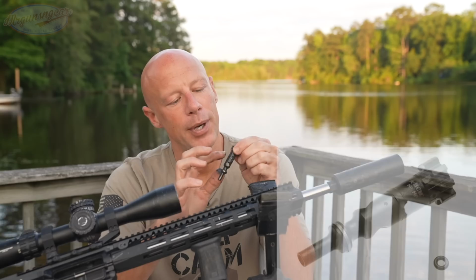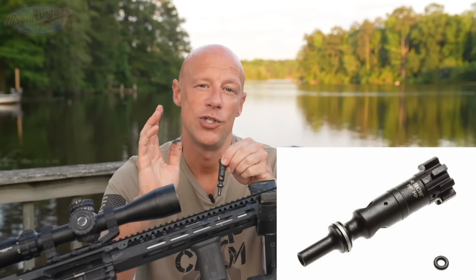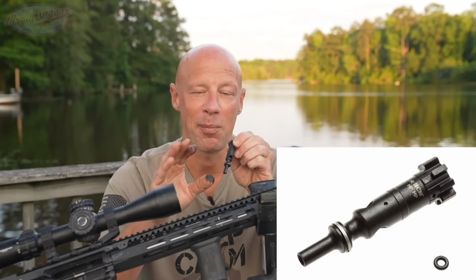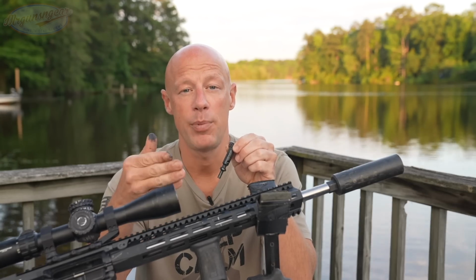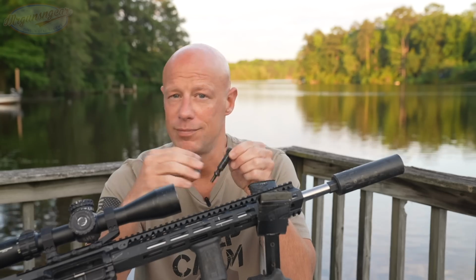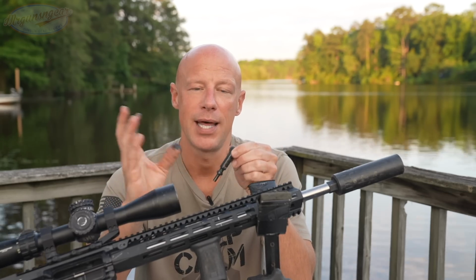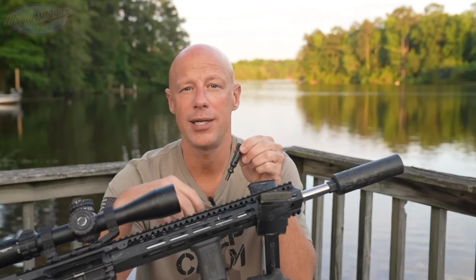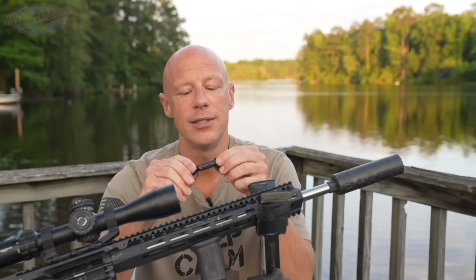And the reason I was bringing that up is this one here is marked BCM HP MP. So just like the barrels, the exact same processes that we talked about. So high HP is that proof round, that high pressure round that they fire through it to stress the steel. And then the MP, or the magnetic particle inspecting, is that electronic signature being put at it to detect any type of cracks or weaknesses in the steel.